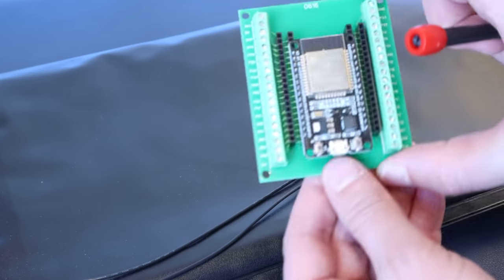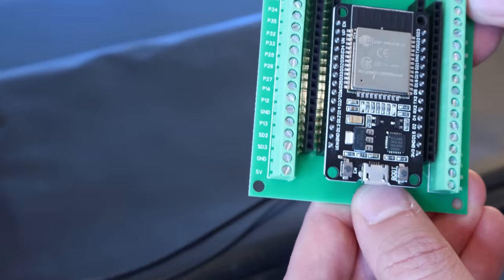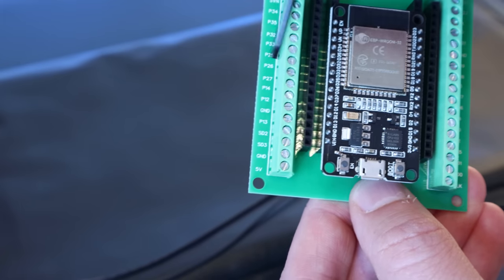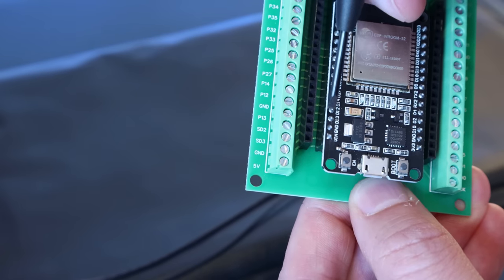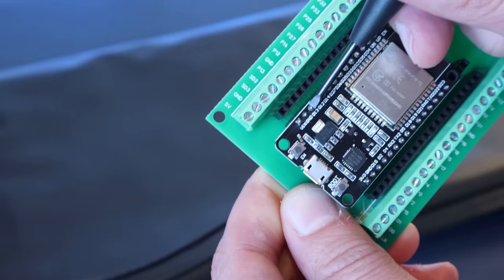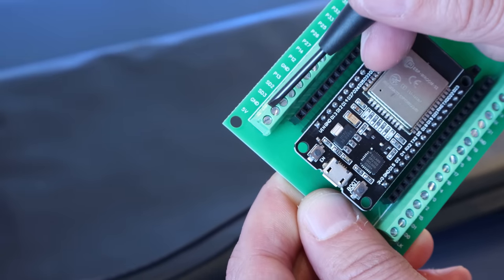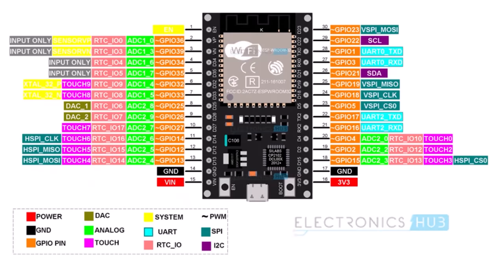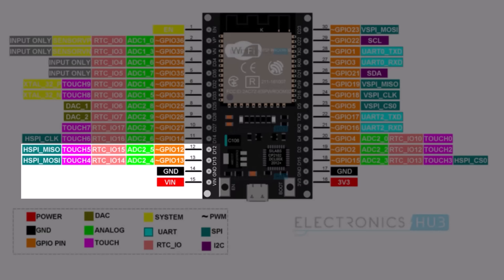I've decided to wire my sensor into the 13th IO pin, known as GPIO13, for no particular reason other than that it's located on the bottom left of the ESP device, right next to where the ground terminal is. The pins are labelled on the ESP board itself, and they probably don't correlate perfectly with what's written on the prototyping board, so make sure you double check the actual labelling on the device. There are some great resources online that show you what each of the pins mean, and I've linked to some in the article on my Home Automation Guy website.